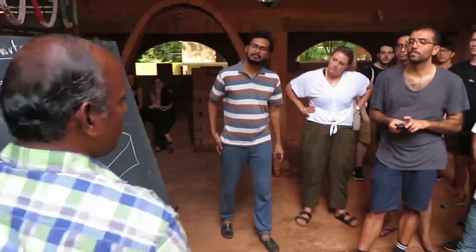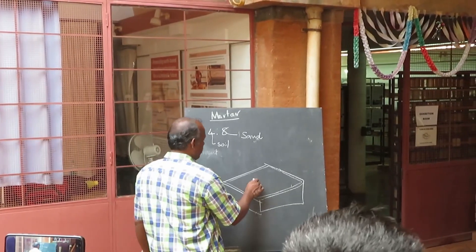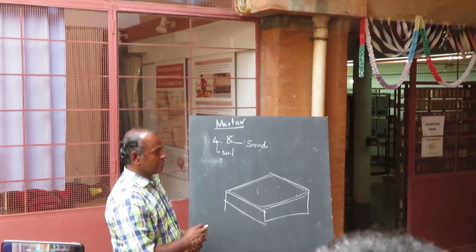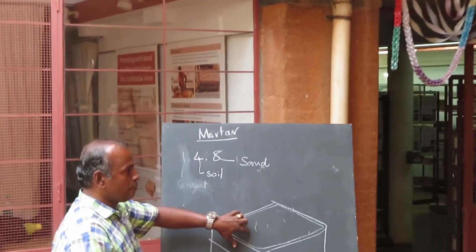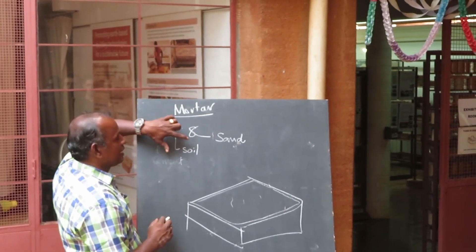So this is the area of the bricks. Apply it one centimeter to observe if there are any cracks left. Like tiny air cracks means there is still too much clay. So in that case, you change the proportion — reduce one part into this one part.